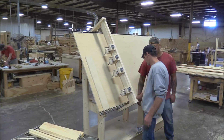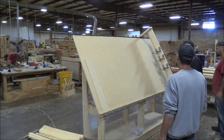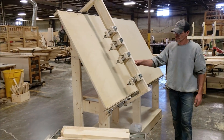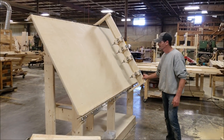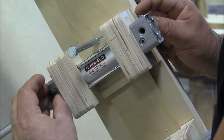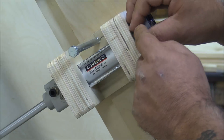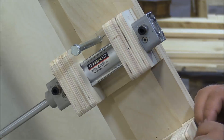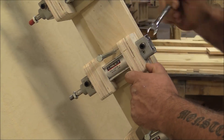We can lock them in place with the bolts. After the boss approved the quick inspection, we started assembling all the hoses. We haven't done a lot of hose management yet — we'll do more of that and add a laser alignment system and a few other things — but for this video we're just getting it working. These are push couplings: you screw them into the clamp and then just push a quarter-inch rubber hose in, and that locks the hose in place.